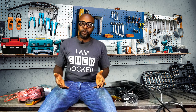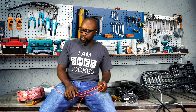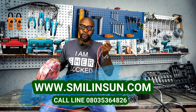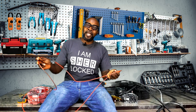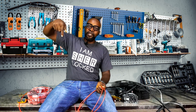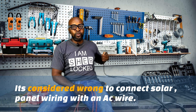Another common mistake is using AC wire for a solar installation — that is a terrible wiring choice. Here is a 4mm AC cable, and some installations are done with this type of wire connecting solar panels down to the solar charge controller. That is very bad wiring. You should always use a DC wire for your solar installations.